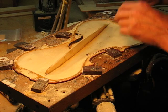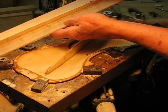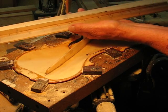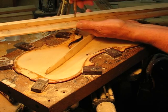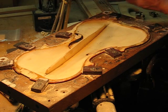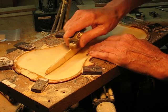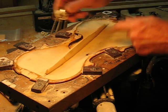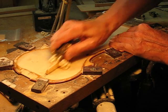We started with it too tall, so what I'm going to do is use the wood reference tap tone. Here's 176 — you can hear that it's too high all over. We're just going to start whittling this down. Approximately the shape you want: it's going to be highest right here at the bridge point, tapering to both ends.